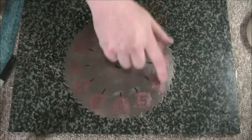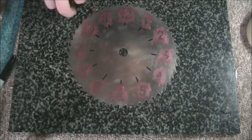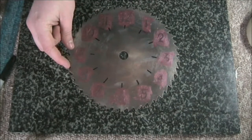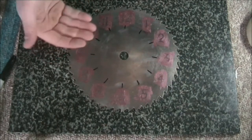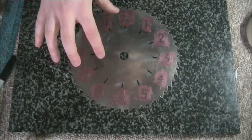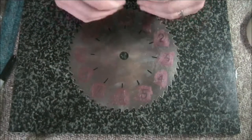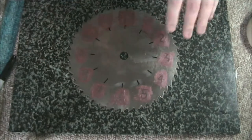When it comes to the numbers, I'd recommend doing each number in two stages of 45 seconds each. After 45 seconds you can clear off any residue that's stopping the acid getting to the metal, and then that total of a minute and a half should give you a really nice etch.